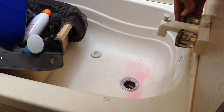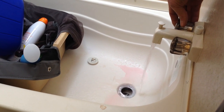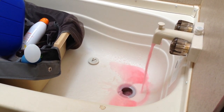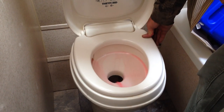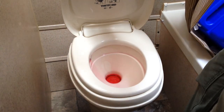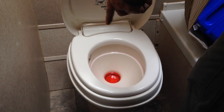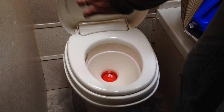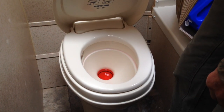There's cold. Now we got hot, so we'll just run a little extra through it. And that's it for that. So you just keep flushing it until you get antifreeze, and then you just leave it like that. Leave a little bit to see the black ring down below — that's a gasket down there. Having that antifreeze sit over the winter just like that helps protect that seal. So just let that sit just like that.